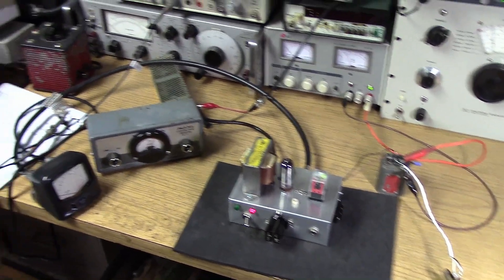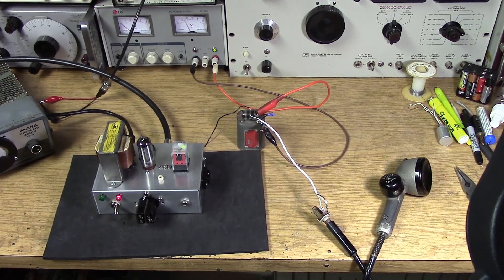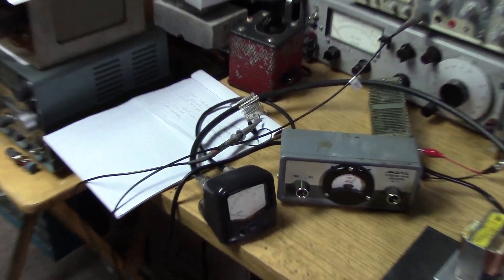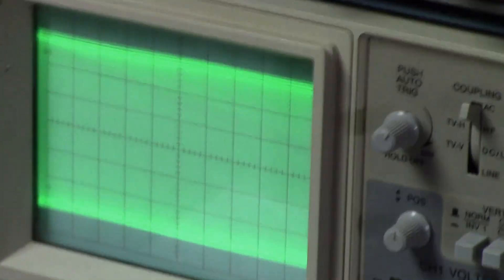I've got the power cut in half to 500 milliwatts but we're still putting something out. I'm using an interesting setup to get a nice carrier on the scope even though it's only a 15 megahertz scope. By using a tuned circuit - just a coil and capacitor slipped over the coax - I'm able to tune it to 29 megahertz, which helps the scope discriminate against the 9 megahertz signal it would otherwise be sensitive to. That gives you a much more pure-looking signal on the scope.